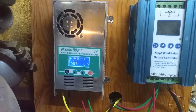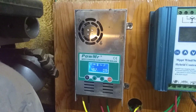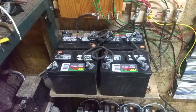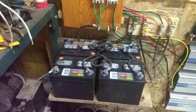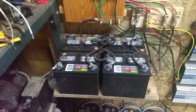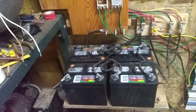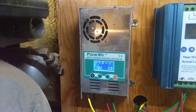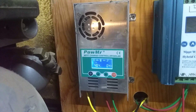A little bit over a day later trying to use this MPPT charge controller to transfer power from my 48 volt bank to my 24 volt bank. All my load comes off of my 24 volt bank, and one of the issues I've had in the past was either trying to run loads off of my 48 volt bank which would deplete the bank, or I just had issues trying to run the 48 volt bank by itself. So I'm using this controller hooked up to the 48 volt bank to transfer excess power to the 24 volt bank.